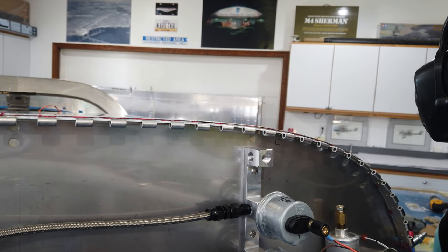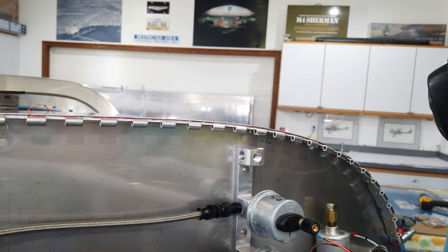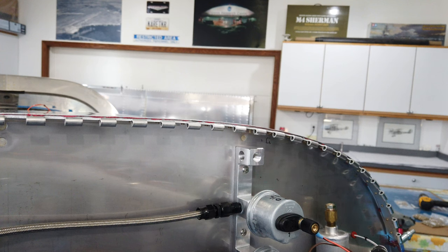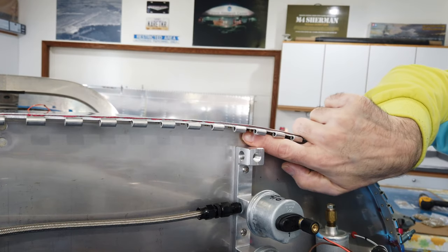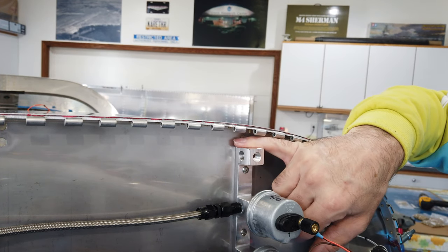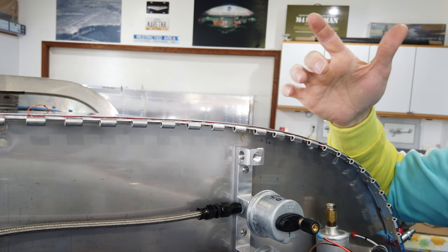What I want to try to demonstrate is: I have to put this rivet in here, and I've got the knuckles of the hinge hanging down in the way, and I've got this little manifold here that's also in the way. You really can't get a bucking bar in here - at least I can't, the couple that I have won't fit - and I can't really get the squeezer in here without doing something kind of different, so I'm going to do something kind of different.